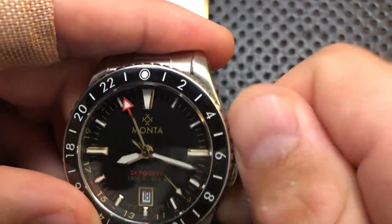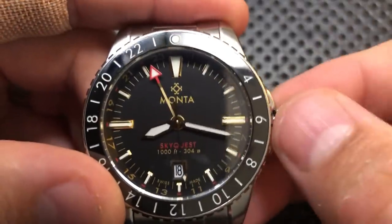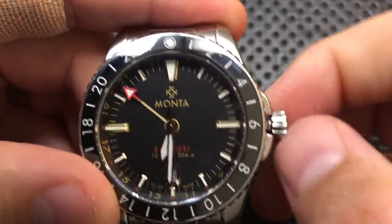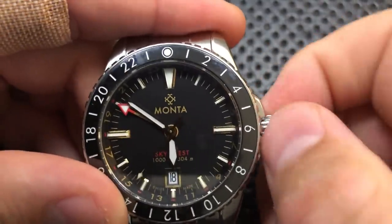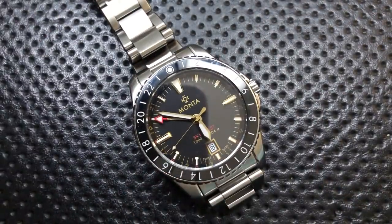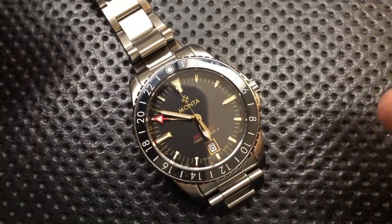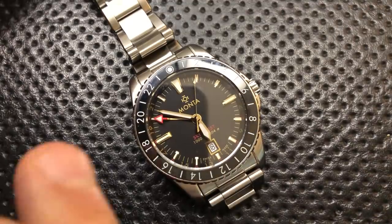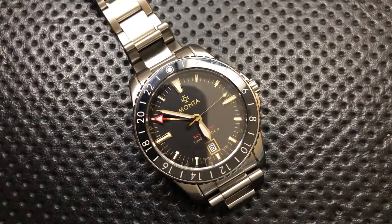It's also a hacking movement — if I pull the crown all the way out, the second hand stops, which allows you to set the seconds precisely at the same time as the minute and hour. And this is a movement that can absolutely keep time well if regulated properly. This one is regulated to about 4.5 seconds per day on the wrist across the five days I was wearing it — in one position plus six, another position plus two, averaging out to about 4.5. One of the things I love most about Monta is that they guarantee accuracy: plus or minus five seconds a day. I love that they're willing to give that accuracy guarantee when a lot of brands simply aren't.